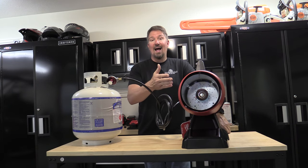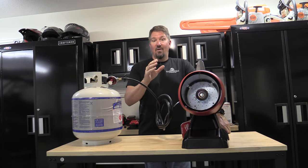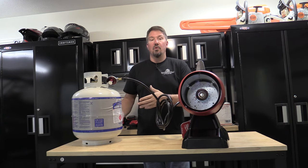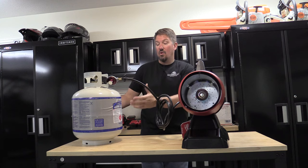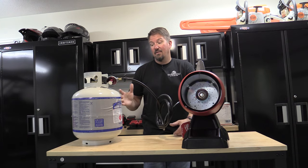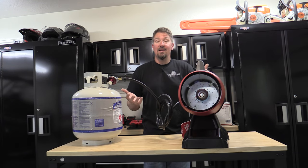Make sure you have a door open. They work awesome — they just need a little bit of clean air coming in, and you're going to need a lot of propane. People are going to ask how long it takes to go through a tank. On high you could go through a 20-pound tank easily within five hours max. This thing sucks propane but you're getting a ton of heat out and it is fairly clean.